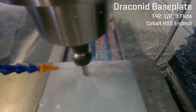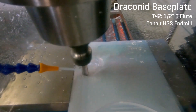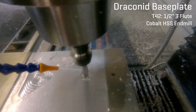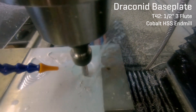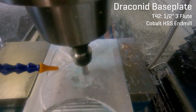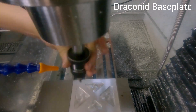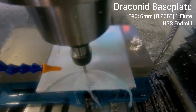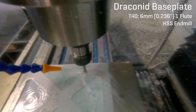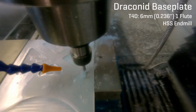I pretty much have most of the surface area of the base plate pocketed out to about half of the depth that the material starts as, which is a quarter inch, so most of it's being pocketed out an eighth inch. I'm using a half-inch cutter to do the bulk of this work, because even with such a large diameter cutter where I can make a full depth pass, this is still pretty time intensive — about 10 minutes or so. Then I clean up with a 6mm cutter to get sharper corners and make the part look nicer, and I'm also cleaning up the edges with contour passes.